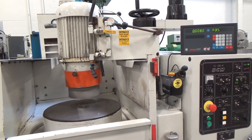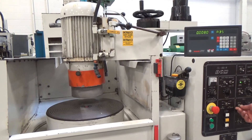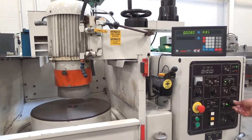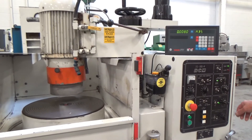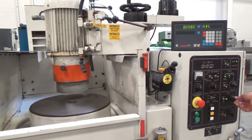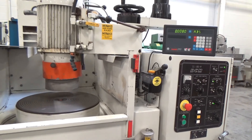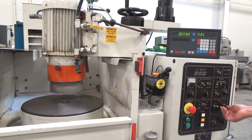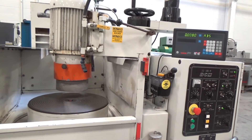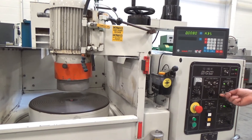We'll shut it off and run the table once. Spindle brake. Table on at 15, which is about 25%. Then up to 50%, just about all the way up at 75–80%, and back down a little bit. We'll bring the spindle back on line, then do a couple of auto cycles.